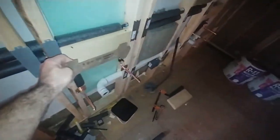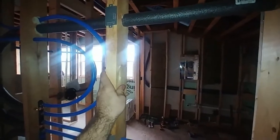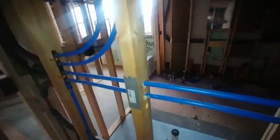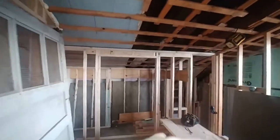And so long as they use inch or inch and a quarter fasteners after the drywall and on top of that inch board, it should be no problem. I don't know where the other one is, but they'll need it. And in here he'll have to use 5/4 as well for blocking for the closet in some cases, maybe not necessarily. You could block in here, finish the other side of our closet door, block all the way across for the sliding door track here, and block across the top of the closet door.